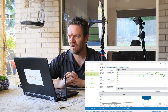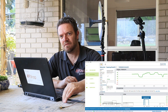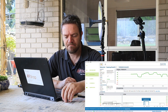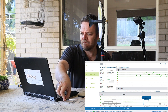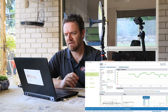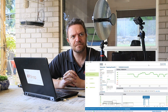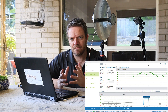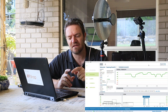With the dipole it's about minus 50. If I move the dipole, put my directional dish antenna back on again - and I turn it back towards the router - what this shows is the directional antenna is working in the 5 GHz band. It's a single antenna, and that's the first proof of concept.